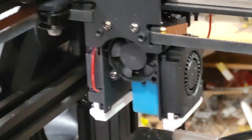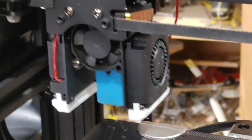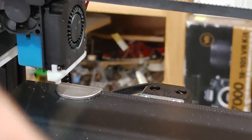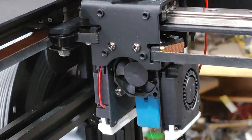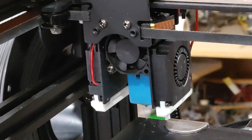I like that, like I said, the structure of these machines is very solid. Yeah, they have a few little issues. Like I have a little issue with this belt here. I don't think the belt is precise. So there's a little bump here, so when I print parts, they're not really precise. There's a little jaggedy movement here as the machine is moving. But I think that's either the belt or maybe the pulleys that are not truly concentric. Anytime you don't have a concentric pulley, you're not going to have as precise a movement throughout the complete travel. But I can live with that.